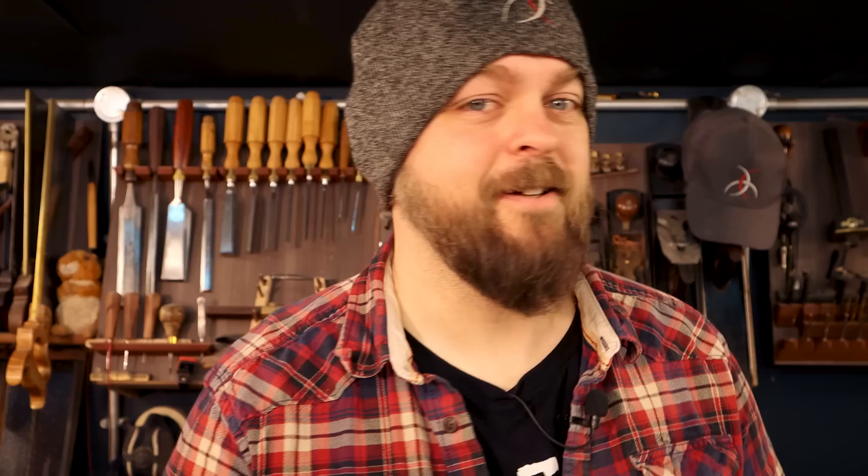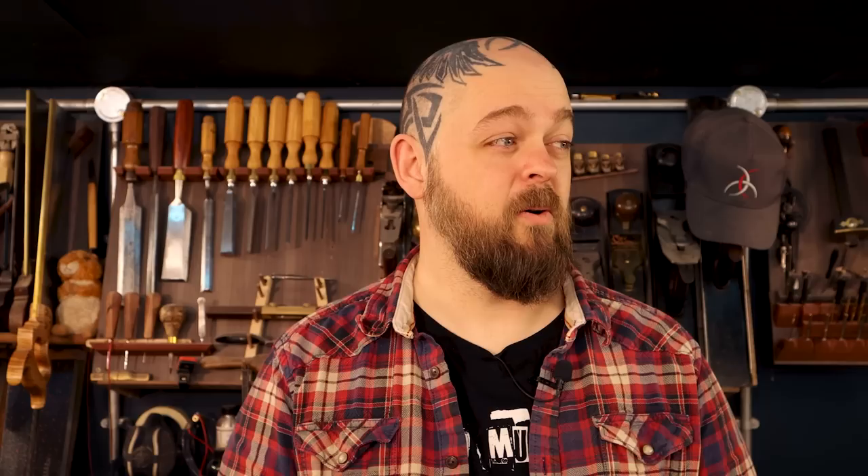I suppose the debate really is: do I need another plane? I'm not going to make a router plane instead of a rebate plane. The issue is that the job for which I'm building this plane is a slot that is blind — cut off at either end. And the plane isn't going to do all of that unless I make it into a bullnose rebate plane, or I go utterly insane and make one with a removable nose — or toe, not nose.